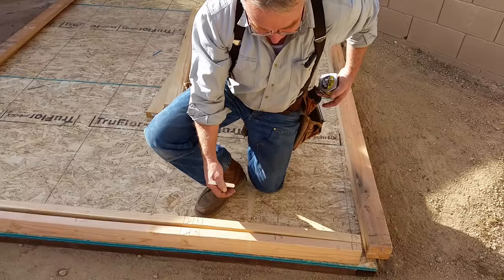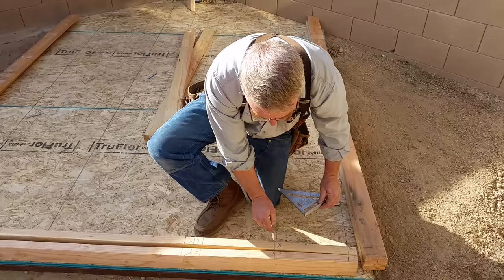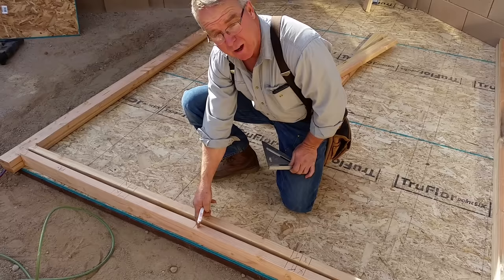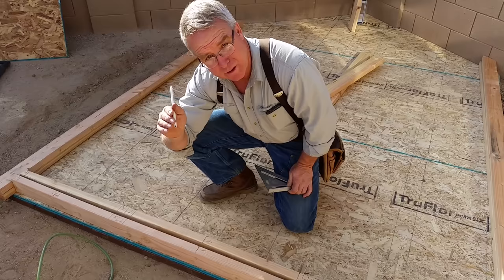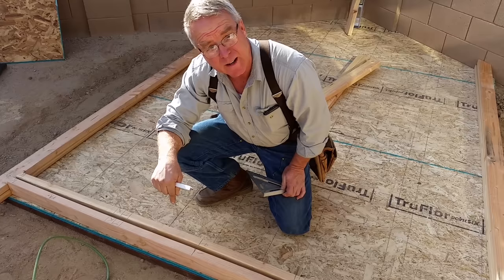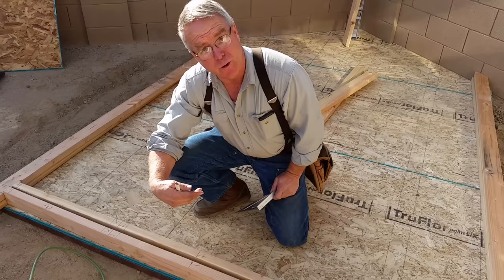Let's throw a mark across here. This would not be a stud, so it's not going to get an X — this will be a cripple. A cripple designates a vertical member in the location that a stud would occupy, but one that either doesn't run all the way to the top plate or all the way to the bottom plate. They usually occur over or under an opening. This is a top cripple above the door header.